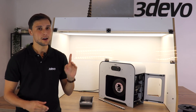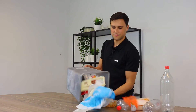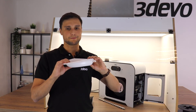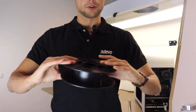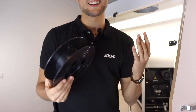One thing I would like to mention is that not all plastics can be recycled into 3D printing filament. In the first video we had a whole table full of plastic waste collected from our office, but not all of those materials could be recycled into 3D printing filament. Also, not all materials are actually the same. We chose polystyrene spools, but we could have also gone for polystyrene plates — they're the same material but actually a lot weaker. This spool is super tough, but it's both polystyrene — just a different grade, made by a different supplier with slightly different properties.